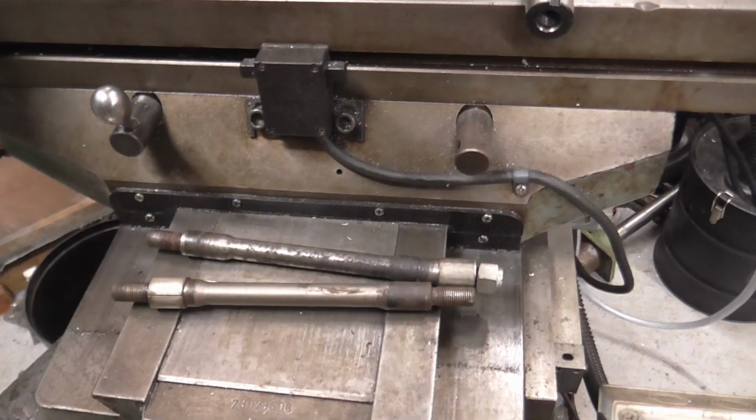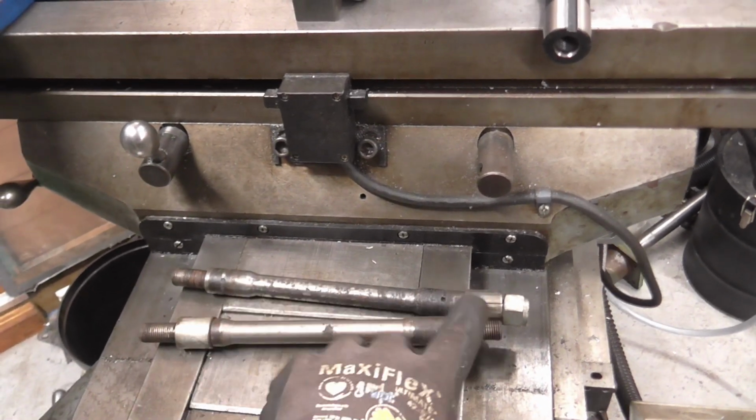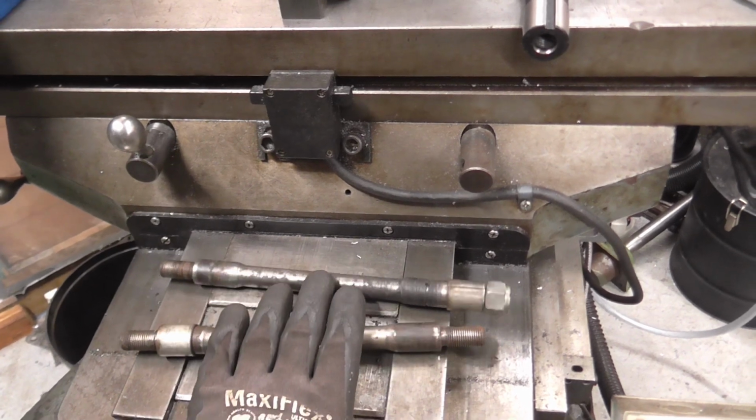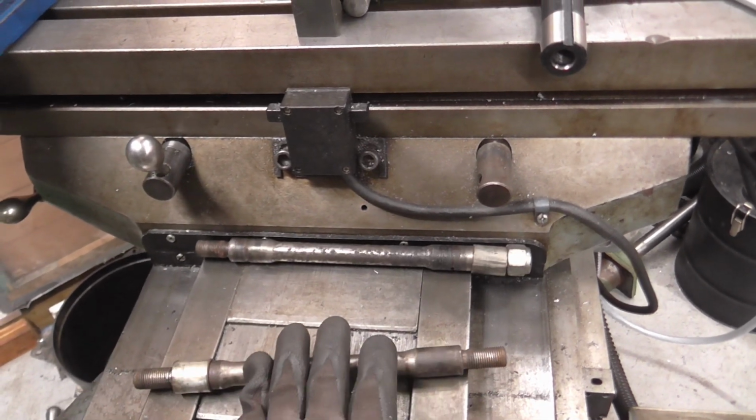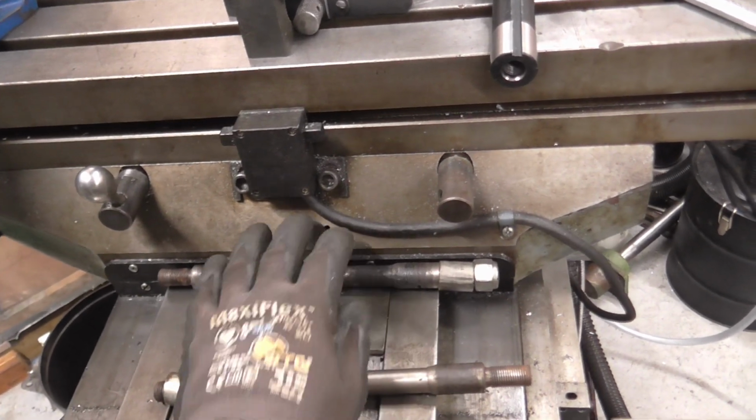Now, some considerable time ago I repaired the door beams for my Lotus Excel project. Repaired all the fairly extensive rust that there was. But the secondary problem, which is very common to these cars, is the hinge pins. So these are the original hinge pins and a couple of bushes. These have suffered from a lack of lubrication over the years. There's no factory provision made for lubricating.